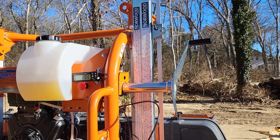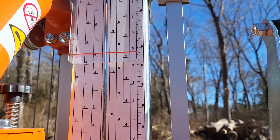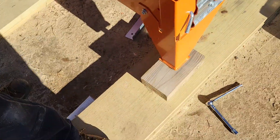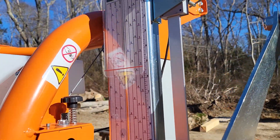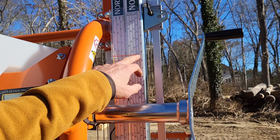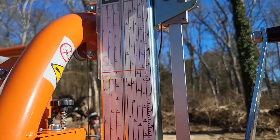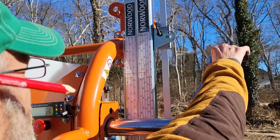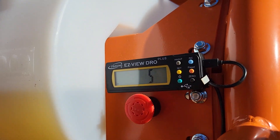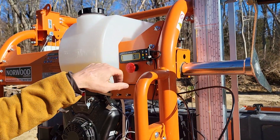The reason we did it is because it's so much more accurate than just using your eye, even just for height differences. If you're looking at the line from up here versus down here, you get a difference in accuracy. If at the beginning of the day you're standing tall and at the end of the day you're slouching more, you'll get a different read. This will allow for a more consistent cut between cutters. You can see that red line is really subjective — it's easily a thirty-second of an inch wide, and you have parallax based on what angle you're viewing it. I set it up so that standing tall, the black line is right at the top of the red line, which is five inches exactly. If you dip your head up or down, your observation angle changes a lot. This gives you the exact position.